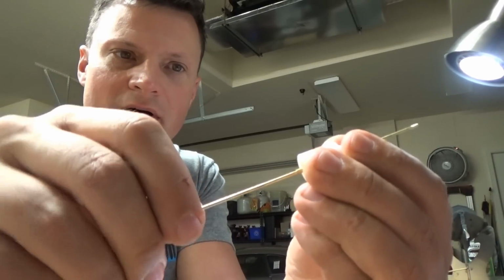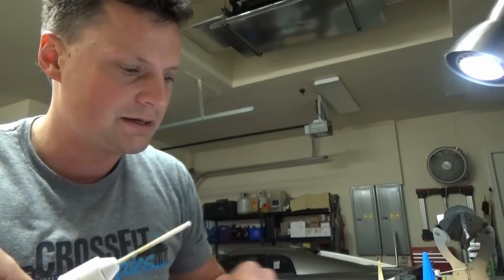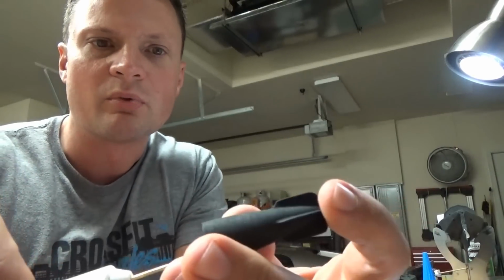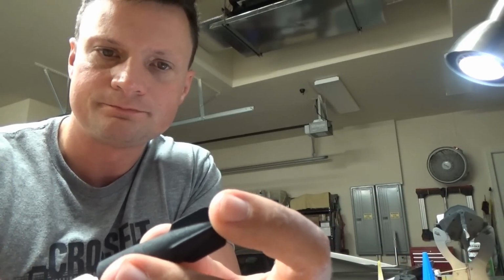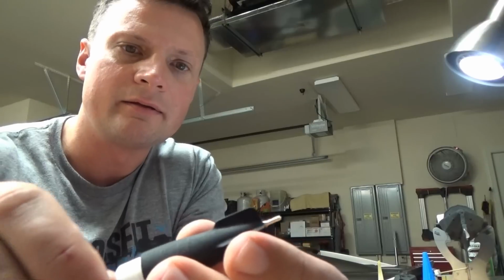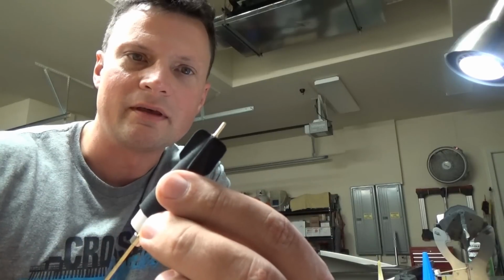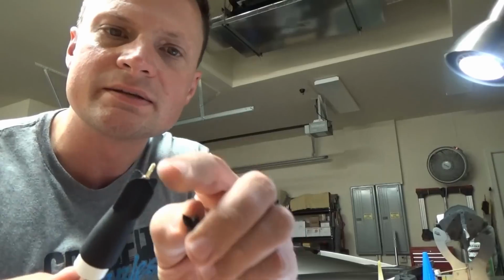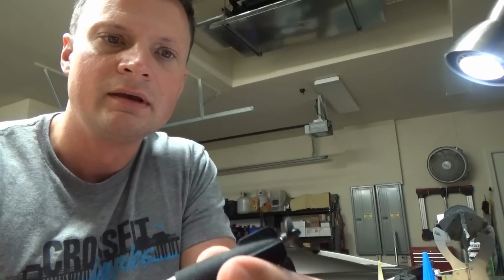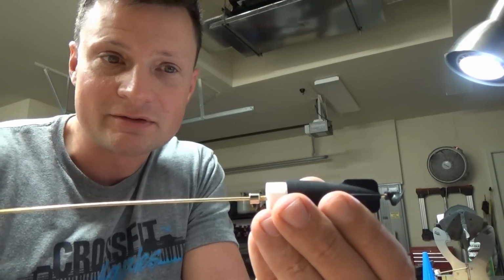And I've got this wheel collar that's going to slide up and just pin it loosely and keep everything all tight together. I have a brass bushing in the back there made from some brass tubing, and the idea behind this, I'm going to try and line this up without actually looking at it. There we go. So this is the rear assembly of the torpedo. Got the prop shaft sticking out the back there, and my idea is I'm just going to use a little bit of silicone and adhere the prop to the prop shaft. It'll go on something like that. So I'm pretty excited about how it's turning out so far.